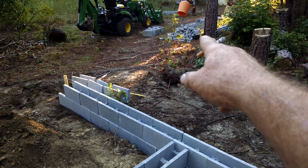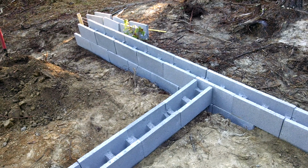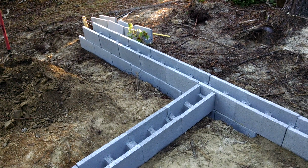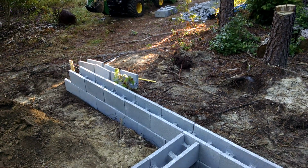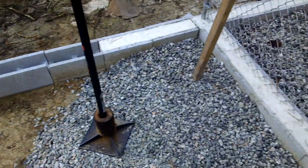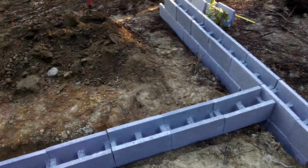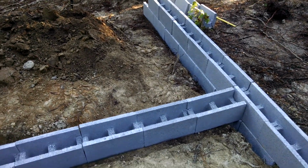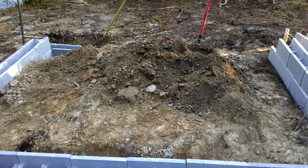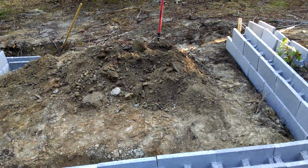And then I got my little knockout pieces that come out of the middle of the block, and that'll prop it up and keep it up in that concrete so it's not on the ground, because you want the wire in the middle of your concrete. So I'll use those to prop it up with, and I got plenty of those to use in all 3 pens. And then I went down yesterday and got 6 more of the knockouts. That's all they had left, was 6. I didn't have enough for the end wall with that step, so I got 6 more. From my count I only needed 4, but they only had 6, so I bought all 6 of them.